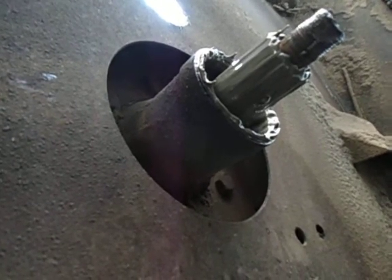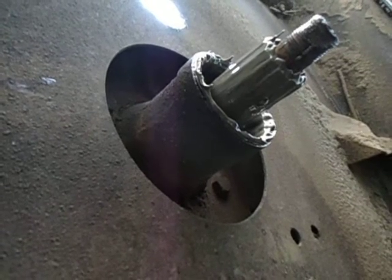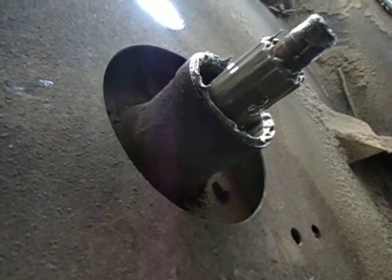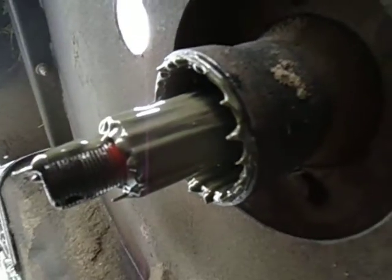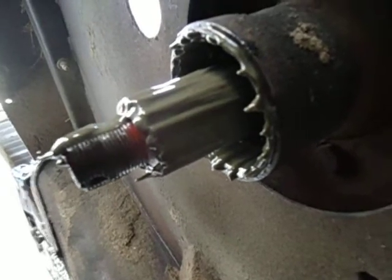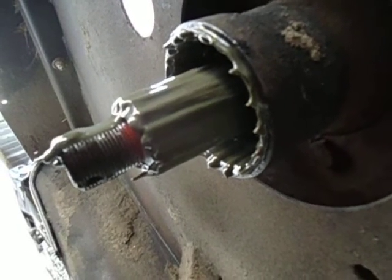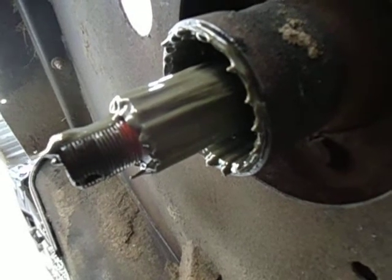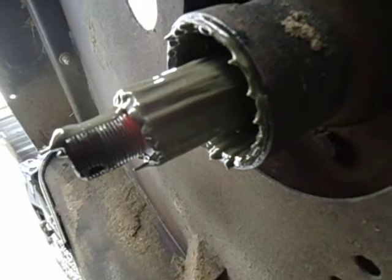Adjust the castellated nuts to firm up the bearings on the output shaft on each side. New seals and retainers. New stump jumpers. And she should be good to go. I'm going to let it drain a bit, put this thing back outside, get out of the barn, put the tractor back in the barn, and get these things posted. Thanks for watching.